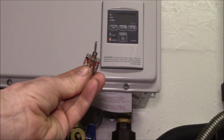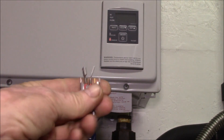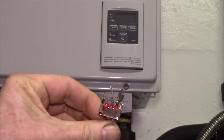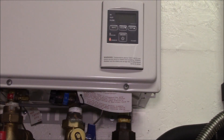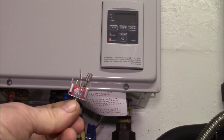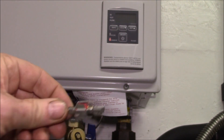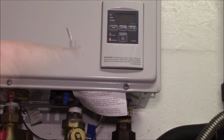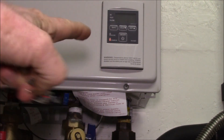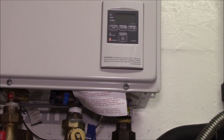So my thinking was: I've got this remote control cable right here, and I could add a priority switch. I've got a little toggle switch with a male and female spade lug on it, and what I'm going to do is cut one of the two wires and run that cut wire through this switch. If I close the switch I get the remote in the kitchen working; if I open the switch I get this remote working.